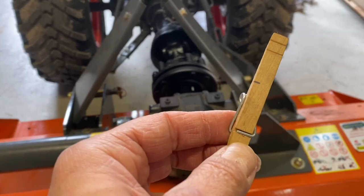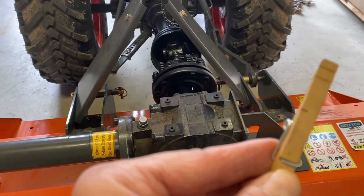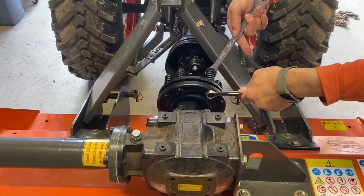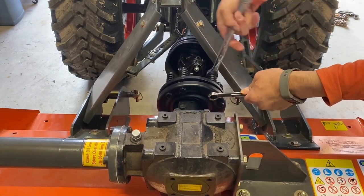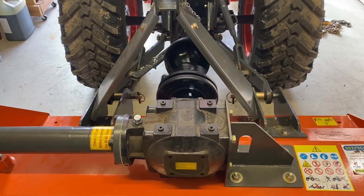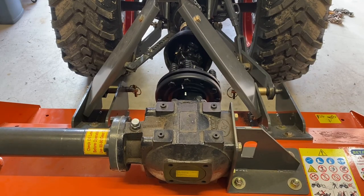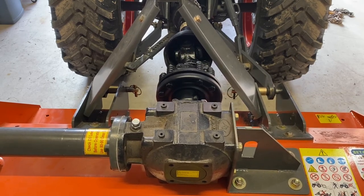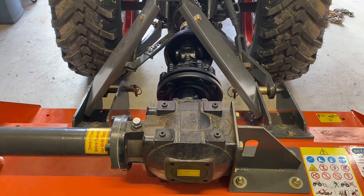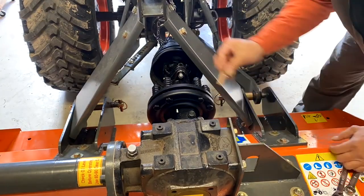Before I backed her off, I took a clothespin and a pencil and marked how tight the springs were so I can tighten her back up. I'm loosening all the bolts now so that the clutch will slip, and I'll put a white mark on it and engage it. Now you can see the white mark, and I'm going to engage the PTO a few times and see if I can get it to slip. You can hear the drum continue to turn after the machine is actually off, so be aware of that — don't go sticking your hands under there. It did finally slip, so now I'm going to re-tighten all the bolts to the mark on my clothespin.